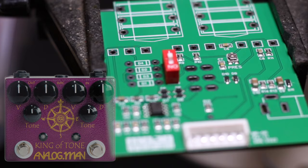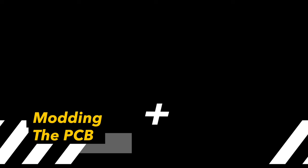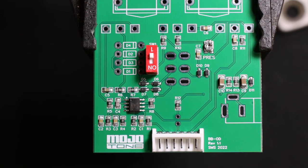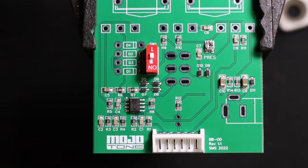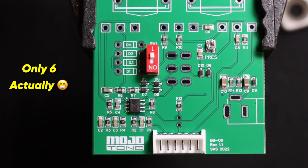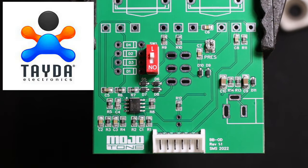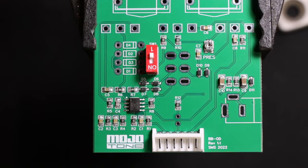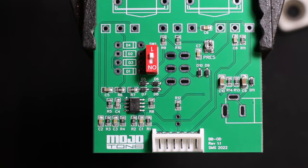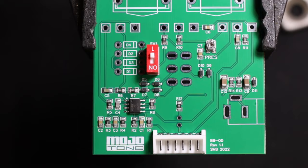The next step is to show you how to modify this PCB — all the different parts we need and where to solder them. The soldering iron's nice and hot. Almost all the components are going to be a 0805 package. I get a lot of these parts from LCSC — they're a really cool company and components are only around two cents each. If you've never soldered surface mount before, it can freak some people out, but it's actually easier than soldering through-hole style.